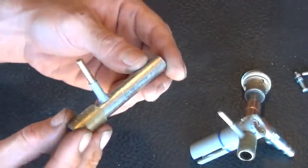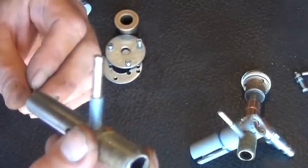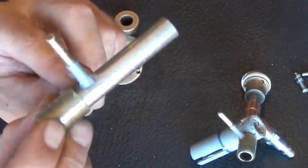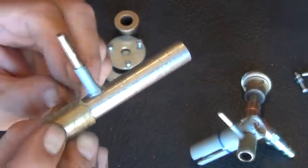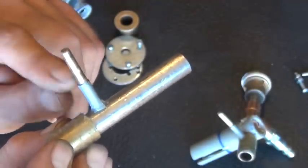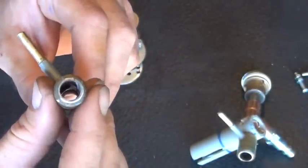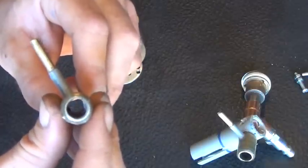And at the other side here, what you see, this little stem sticking out, is our brass, basically our cathode or anode side right here. I'll have to look at it. But that's going in, and I've got an electrical tape wrapped around that where it goes down into our stainless steel tubing here. And it's all glued in with a high-pressure glue, something that's really strong and clear. It doesn't have any metallic flake in it like an epoxy. That makes sure that the contact, the inside edge of this inside the tube, has no electrical connection with the rest of the metal tube. And you can see here, very little impedance inside of there from that piece of brass rod. It's not going to affect our tube very much.